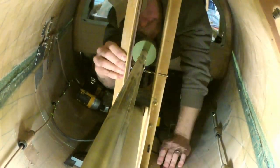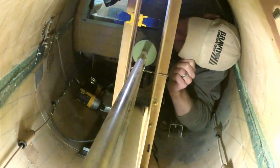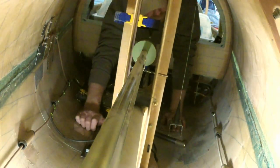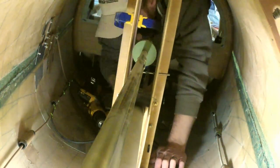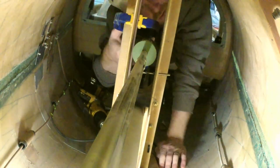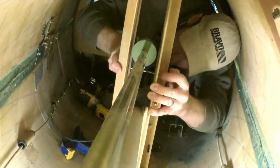While I'm outside getting that phenolic board, I'll talk about this portion of the video. This was recorded the previous day. What I'm doing here is match drilling the phenolic board to the support structure, using the long drill bit you see to match drill from the other side so I know it's at the proper height. I'm also using it to hold the mass balance weight out of the way so I can get to the other holes.